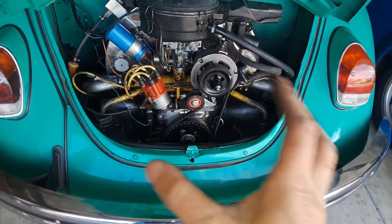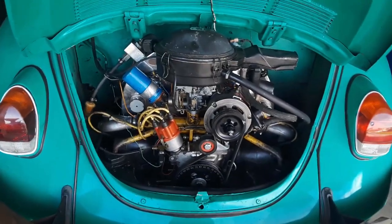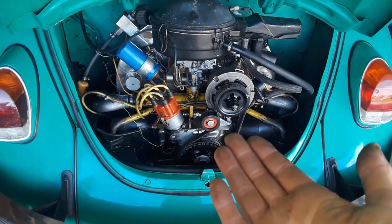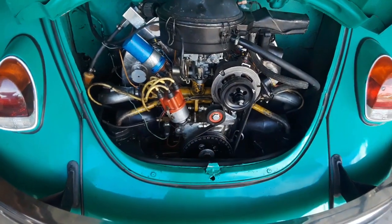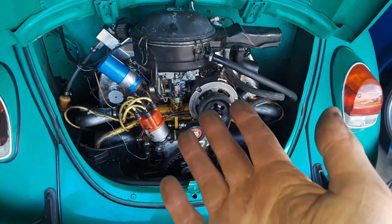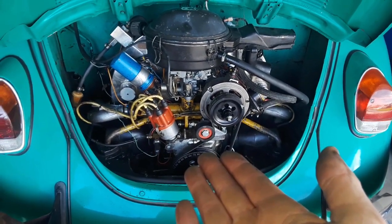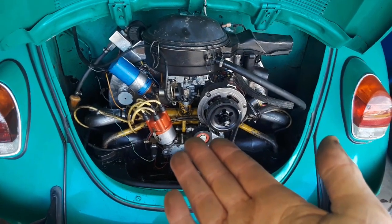Something inside just let go. I drive it like I stole it - this thing sees 6,000 RPMs and I'm always hitting the rev limiter at 6,000 RPMs every single day, maybe a dozen times a day. It's been running like this for five or six years. This high-performance 2234 motor generally doesn't last that long - 30,000 miles is about the ballpark before a mandatory teardown. This thing is approaching almost 60,000 miles, so I got double the life out of it.